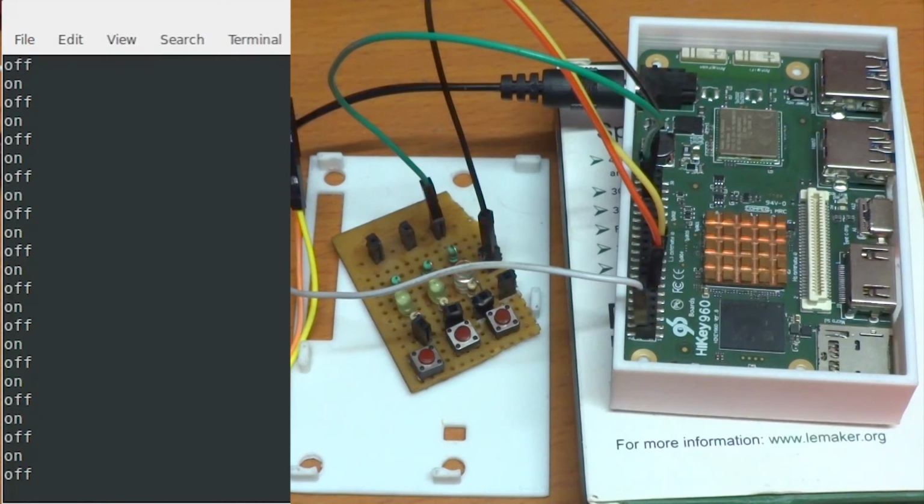I couldn't even get my buttons to work because they were hooked up to a 10K resistor, which is required for safety to work with something like a Raspberry Pi or an UP Board or an Arduino, but the 10K resistor just doesn't allow the voltage to rise up that high to be detected by the GPIO input pins, and hence the button does not work. For me right now, again I will have to rebuild or do something on the breadboard to get that to work. So for now, this is how the setup looks like. Simple red LED on and off. Apart from that, not much.